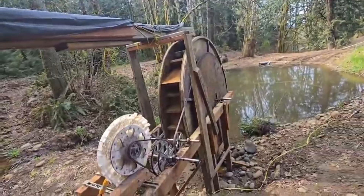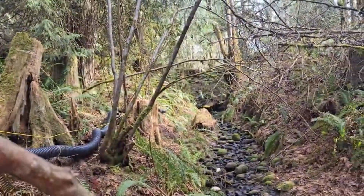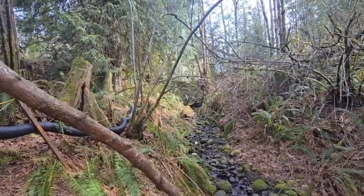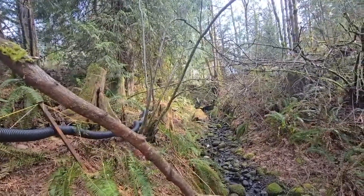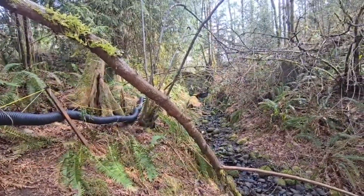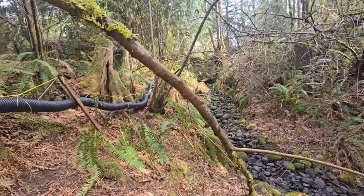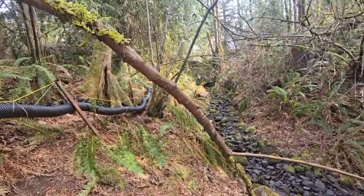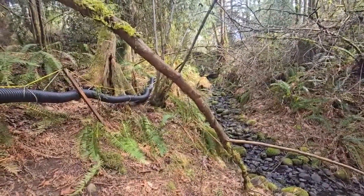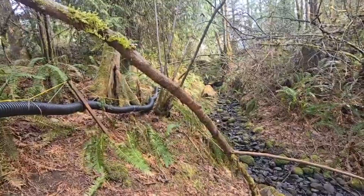It's been a fun project. Let's go turn the water on and let you see what it actually looks like running. Our water pipe comes down from up on the hill — there's a road up there with a culvert, and the bottom of that culvert is probably three feet higher than the top of the water wheel. So this pipe basically catches all that water. What we did at the bottom of the culvert is we made a little dam using a bag of concrete — we put the pipe through a plastic bag, poured concrete in the bag as a dry pour, and it automatically formed around the bottom of the culvert, which worked really well.